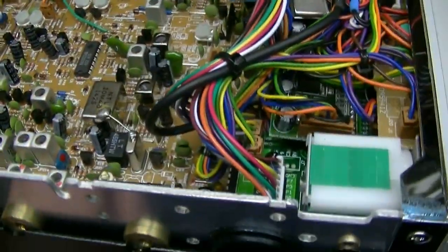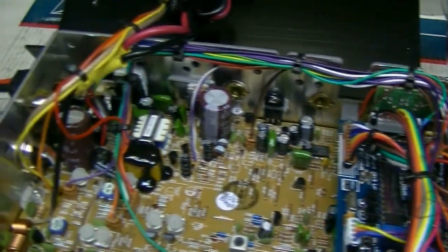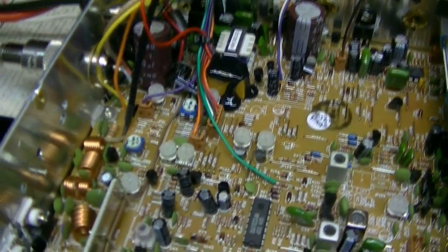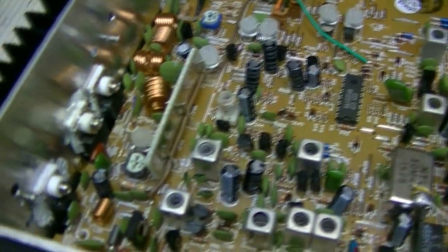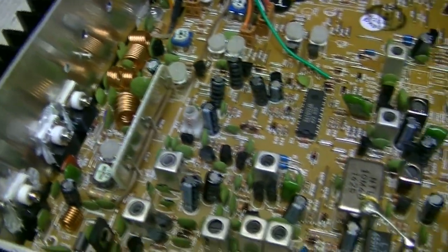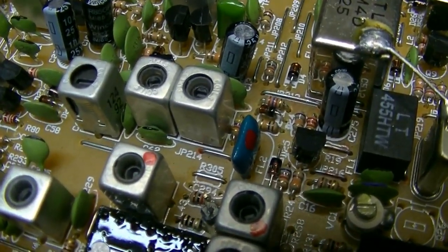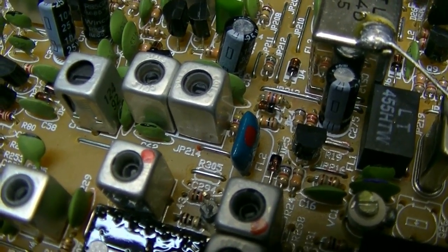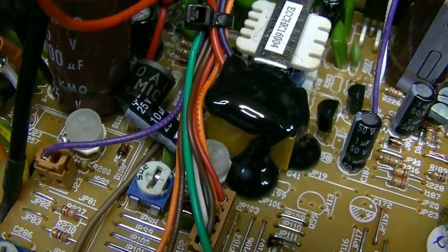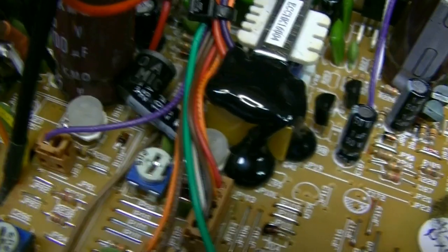Okay, Gordon C. in Florida, this is your DX959, LesComm Custom DX959, I should say. See, I added the second final, added the heat sink, and did my improvements to the receiver. There's your 15 kilohertz wide 10.7 filter. There's the amp relay switch. It takes what used to be the Roger beep switch and now controls the amp with it, the SX350. There's your SX350.